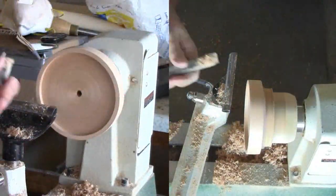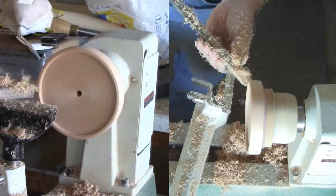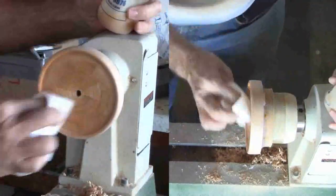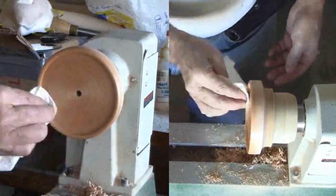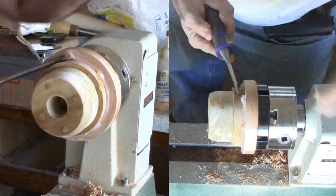Now that I'm confident the mirror fits, I can shape the mirror side of my wood. With a little wood to spare, I'll just round over the edge. Then sand and finish this side with shellac friction polish. Then, using the mirror mortise, I'll reverse the wood on my chuck into a gentle expansion grip — gentle, I don't want to shatter the edge.